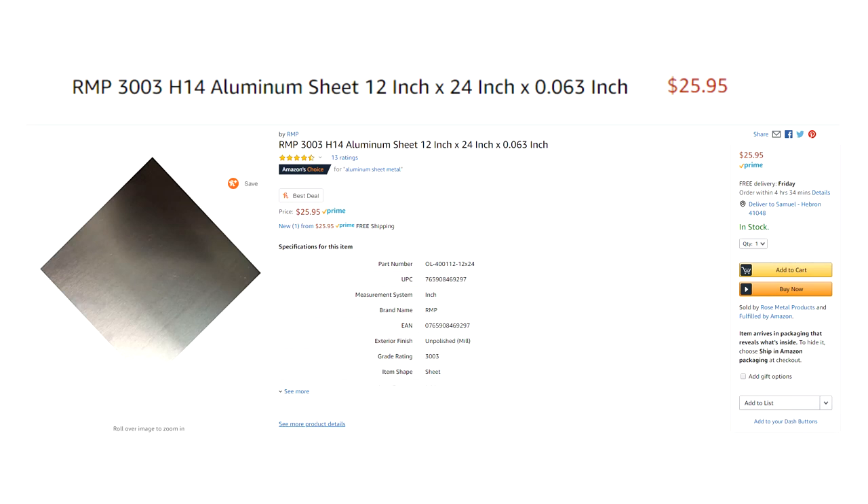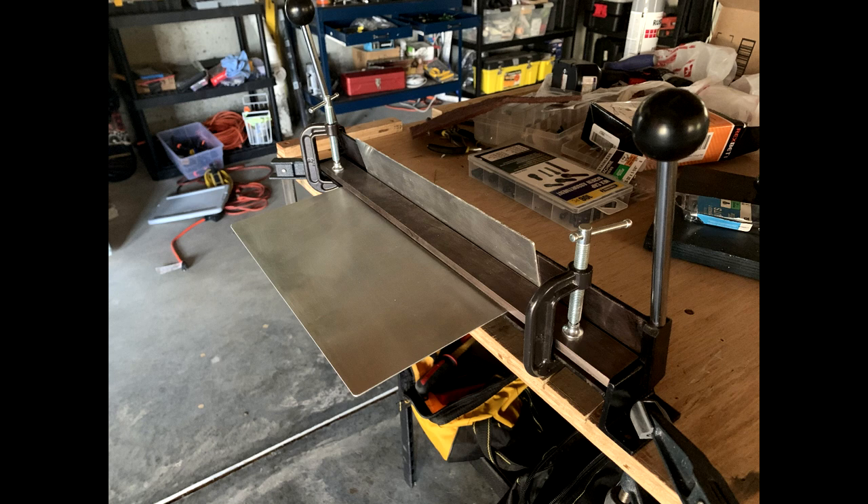I selected aluminum for the material because it's easier to bend. I selected from Amazon the aluminum you see here — this piece was 12 by 24 inches. Now before I cut the 24-inch side to about 16 inches, I would suggest that you lay out your monitor and Knobster if you're using that, and get an idea how wide you need to make the overall dimension. Then see where you need to bend it to allow the mounting of the monitor. I used the Harbor Freight metal brake you see here — fairly inexpensive — and you need to bend the bottom mounting part back so that the top is up at an angle to match the front of the Honeycomb yoke.